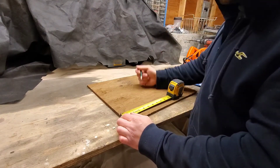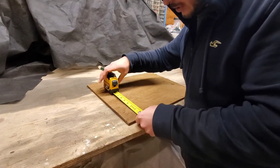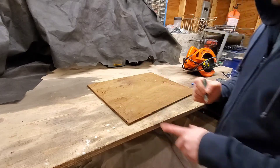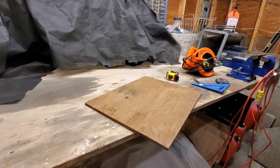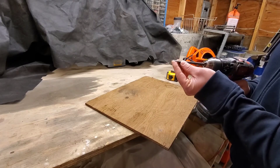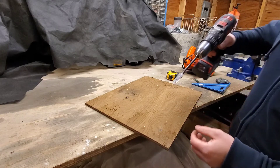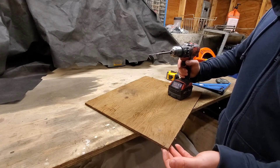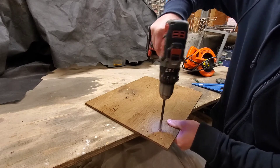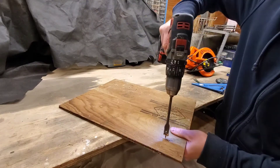Now we need to mark out our hole. Since we have a 4-inch span, we're going to put a mark at 2 inches, then do the same thing at 2 inches the other way — right here is where we'll put our hole. When you drill, get the tip of your bit poking through and then hit it from the other side — that's going to keep your wood from breaking out and will make a nice clean edge. This is only a quarter inch so it'll take about 5 seconds to see the bit going through. There is our hole, and now we are going to drill from the other side.